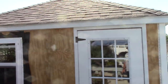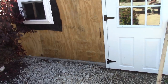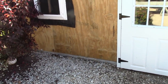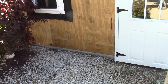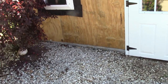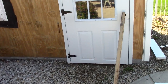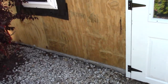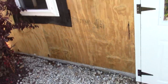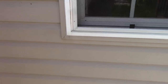A tip to help protect your building: you can wrap it with house wrap or tar paper down at the bottom. That will help prevent splash back from rotting out your plywood if you don't have gutters. I'm on a concrete slab with stone all around the shed, so I have really good drainage and I'm skipping that step — which also allows me to easily see where my studs are so I can nail the vinyl siding into the studs for strength.